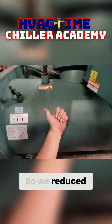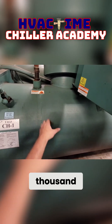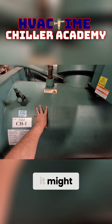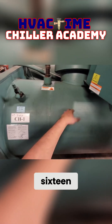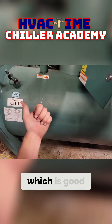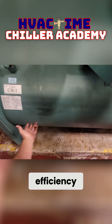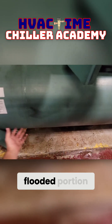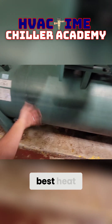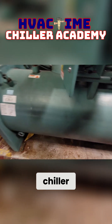This machine only needs around a thousand pounds of refrigerant, whereas a standard flooded evaporator might require sixteen hundred pounds. So the hybrid dramatically reduces the total charge required, which is good in many ways, while still maintaining a lot of efficiency because the flooded portion provides the best heat transfer possible to maintain the load on the chiller.